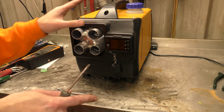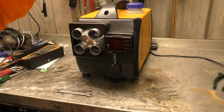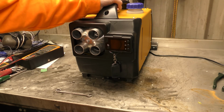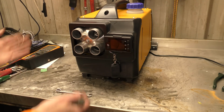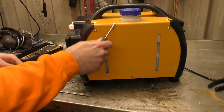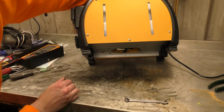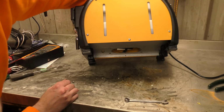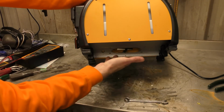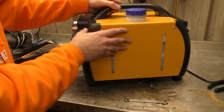Probably, if someone was looking for a heater that runs on 12 and 24 volts for some unknown reason, I would just buy the whole unit, take the heater out and throw the rest of it in the trash. That's kind of the best place for it. I mean, yes, it is a transportable heater. It is an all-in-one. You've got your fuel tank in a metal case, and what it really needs is the exhaust pointed somewhere else, because it's buried way deep in there. It'd be nice if they put a small pipe on it and ran the exhaust out here, so the exhaust and the air intake were separated. That'd be nice. Perhaps I'll put that on in a minute for testing.